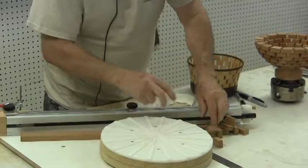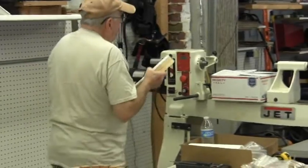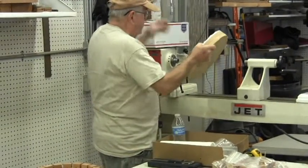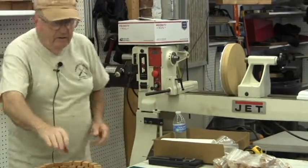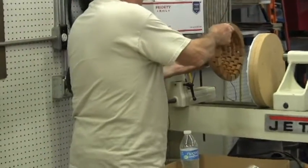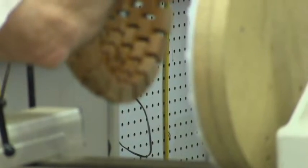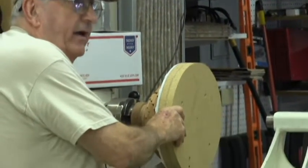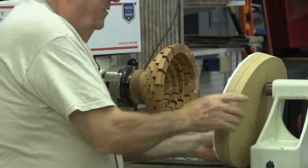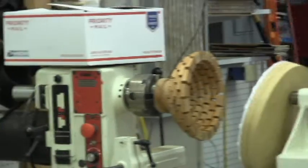Okay. You can take this, the center of it, put it up against your tailstock, shove it forward, okay, and it would meet up with this piece. Okay, and this guarantees you that it's going to match up and center itself. Now you got to leave it there for 2 hours. All right, I am not one to tie the lathe up for 2 hours.